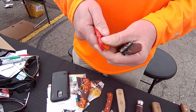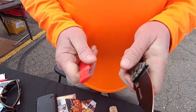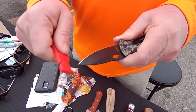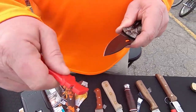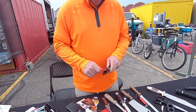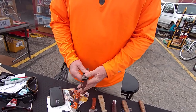Basically, I'm just taking this tungsten carbide blade right here, and I'm taking this 90-degree corner, and I'm just putting it on the same plane as the bevel of the steel blade, just brushing it lightly, just matching that bevel, and we're brushing out any nicks and imperfections in the blade, so that hopefully when we're done, we have a much sharper cutting instrument.